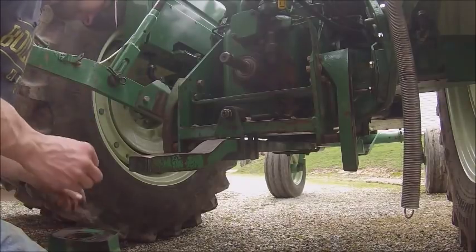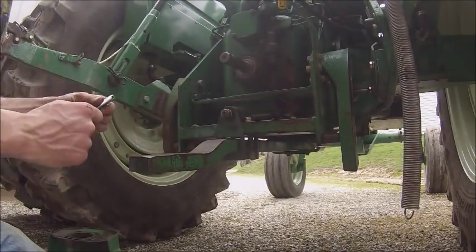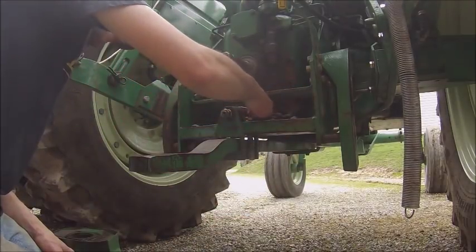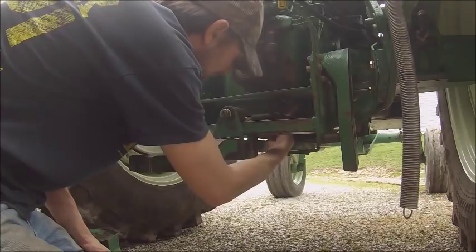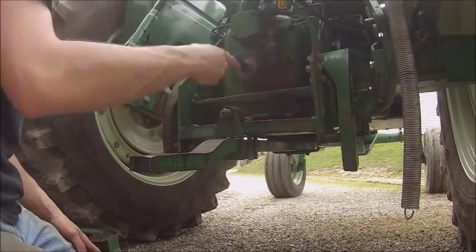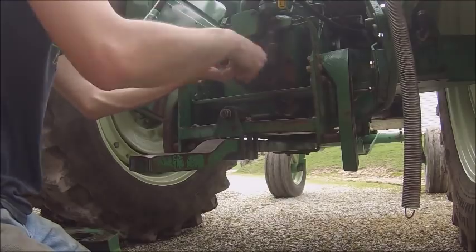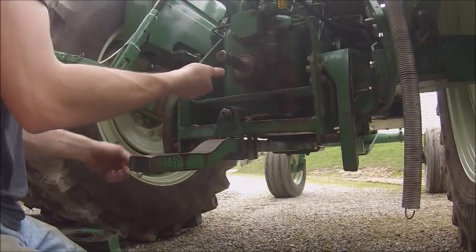Sometimes those don't fit under the old-style shield. There's the PTO shield and the spacer plate — this thing's a little greasy. Before you pull the shaft, use a little crescent wrench because it's easier. Pop that bolt loose and back it out. The shift rail is right here — you thread the bolt into the shift rail so you've got something to hang on to. Right now the rail is in — that's for 1000. For 540 you pull it out, so you pull the shaft partway out, and if you spin it...